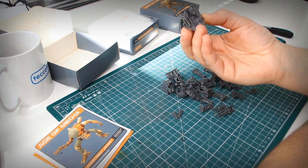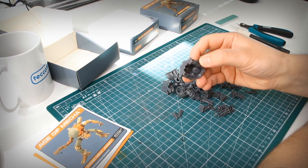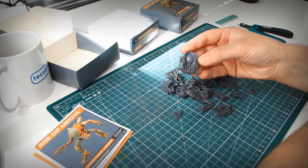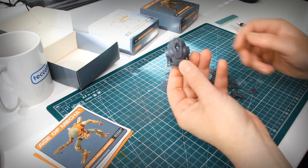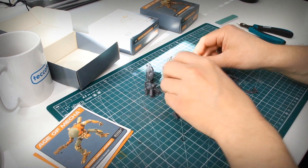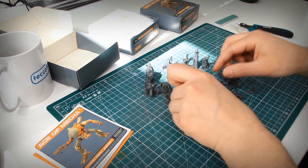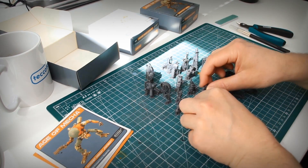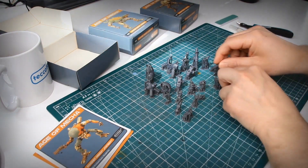For example, when the parts are printed upside down, that's why you have support structures. It's comparable to a sprue or a runner on a model kit but looks very different. When you have all the parts out, the first thing you have to do is remove them from the support structures and clean up any residues left over — basically the same way you would with a standard model kit.